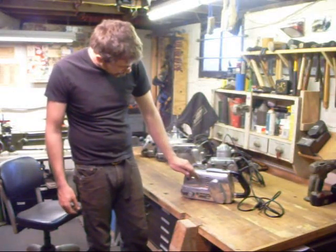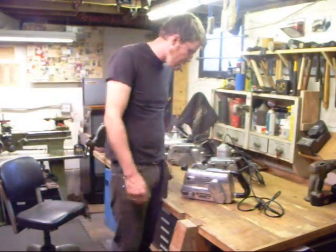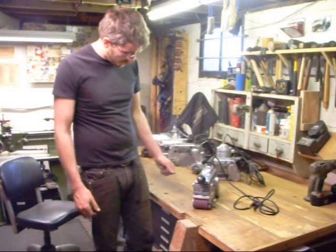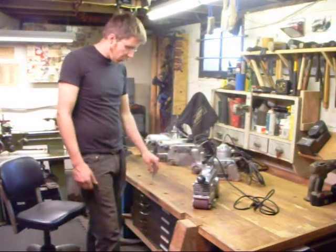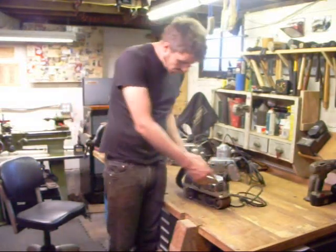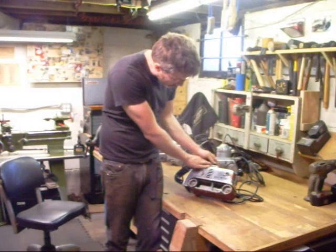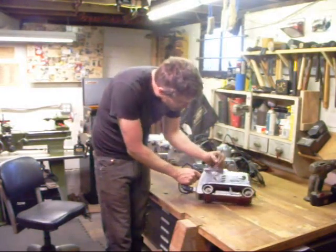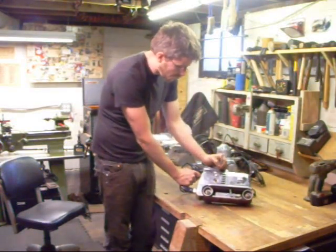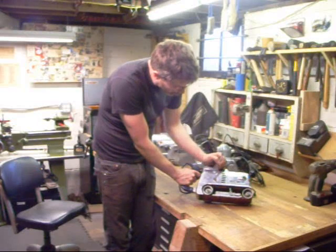None of these castings are cracked — that's a common wear and tear item. There's no scratching on this plate, which is another indication it was cared for. It has the original period-correct knob used on sanders of this vintage. This sander was more than likely built sometime between 1950 and 1954. The paint and the cartouche on the side are still in good shape, and the brush caps are not cracked or damaged. But the main concern for this rebuild is the sight glass on the 503, which has a bronze color on the inside.